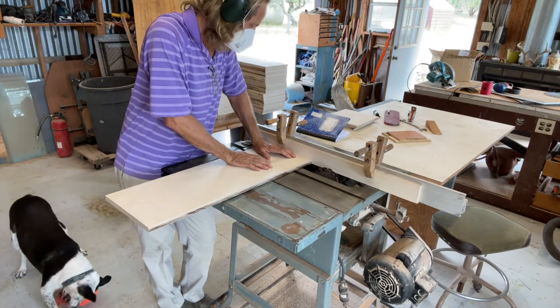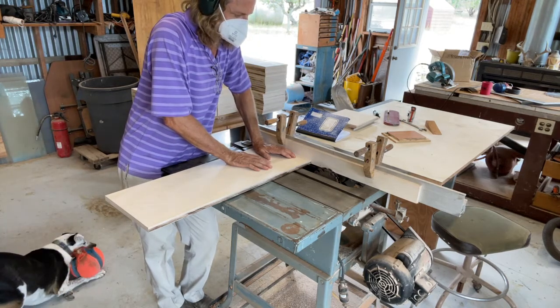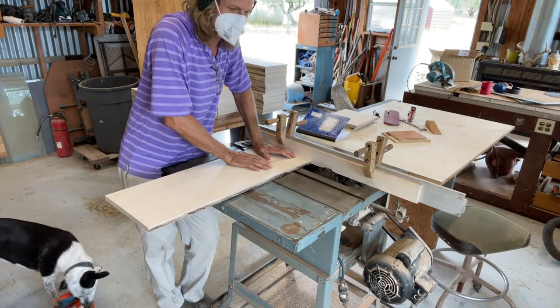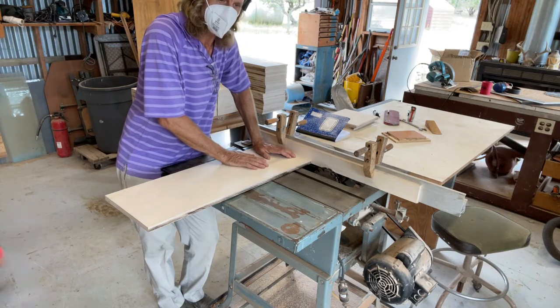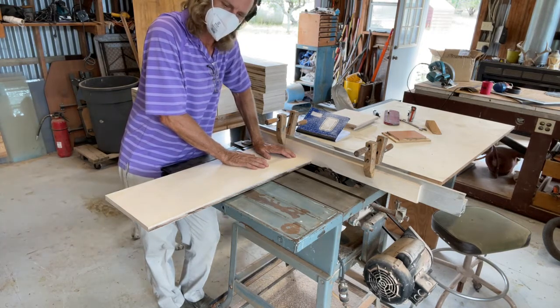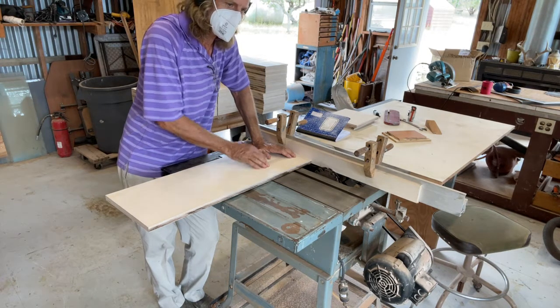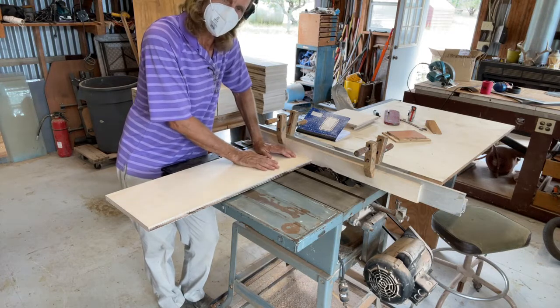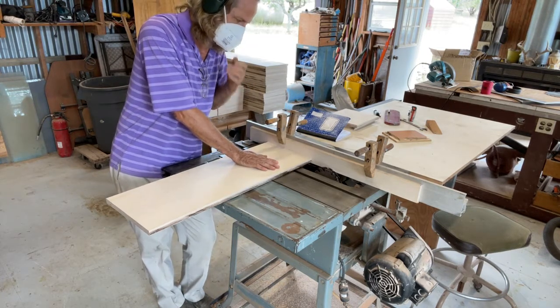That filler plate will help support the piece if it's absolutely perfect with this table. When I'm cutting these dadoes or rabbets, the depth is really critical. And if that filler piece rises up a little, it can throw off the depth of my rabbet.